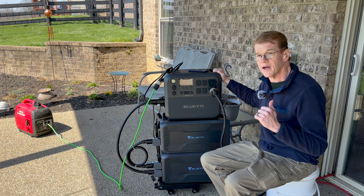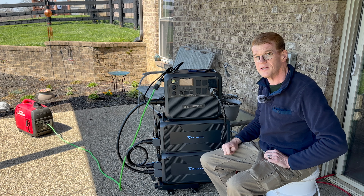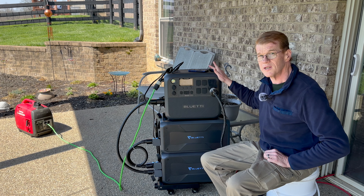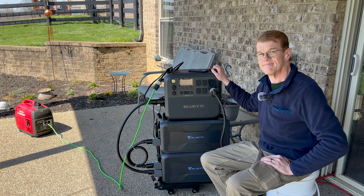I'm going to set this back to standard so I don't forget. The AC 200L is definitely a viable home backup solution by itself with the extended batteries — shown here with 2 B300s, its maximum configurable storage of 8 kilowatt hours, 2400-watt inverter. It will back up my house in a storm situation through the transfer switch. You just cannot connect it to utility power in the home integration way that you can with the AC 300 and AC 500 units, but as an online backup in PV priority mode you can run things directly plugged into this — just not through the transfer switch.